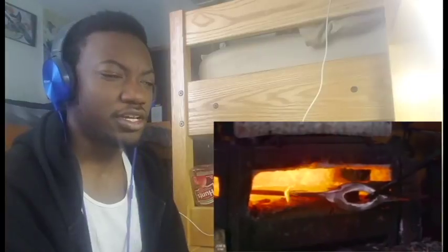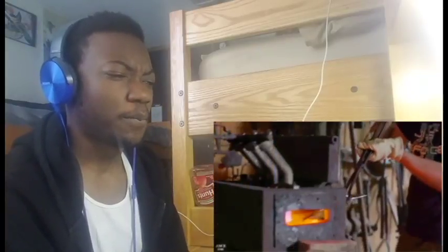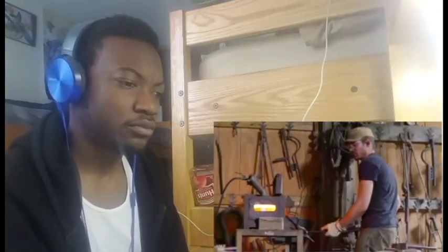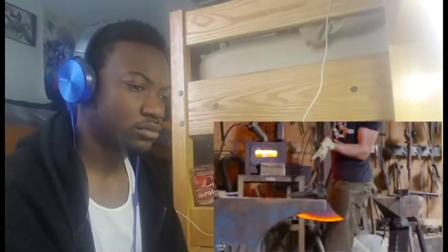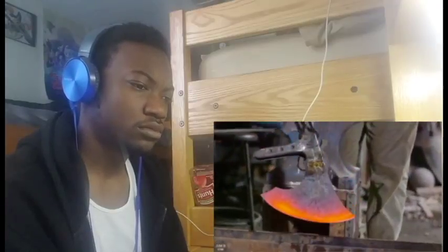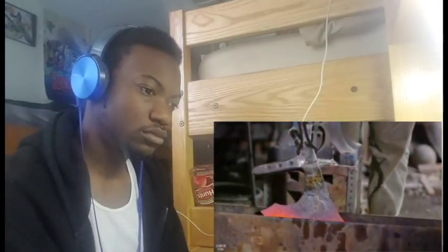Now that we've got all our runes carved in here and the inlay is now complete, the last thing we have to do is heat treat our axe. Ilya heats it up in the forge and quenches just the edge into the oil. Not only does this harden the edge, but it also gets our surfaces crusty again from where we sanded on them before.